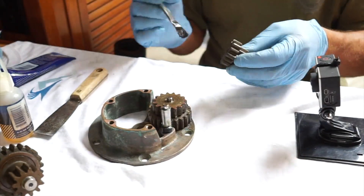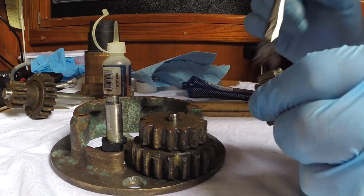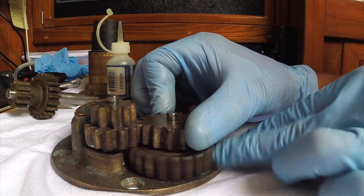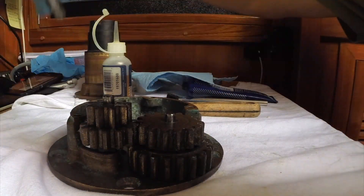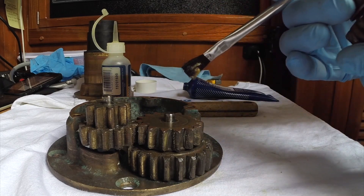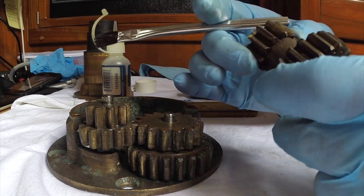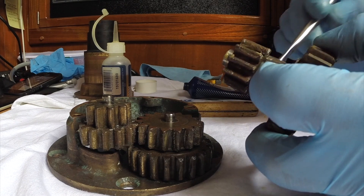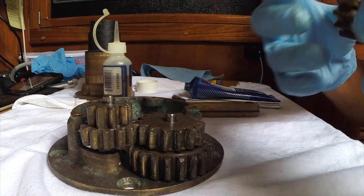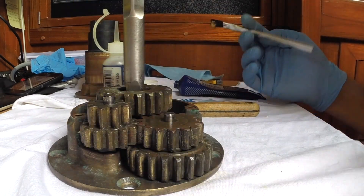This guy sits on some kind of plastic bushing. It fits on here and this turns by itself — this needs grease, just in this little space. There's a tiny space between the two gear boxes where the ratchet pawl and gears go. I'm going to put a little grease in here as well — it goes down in there, all those teeth engage, and that sits nice.